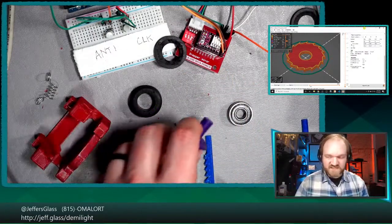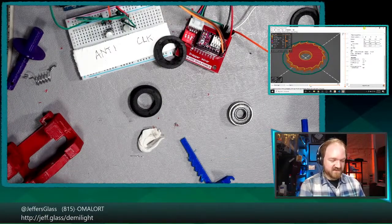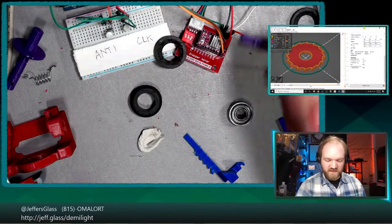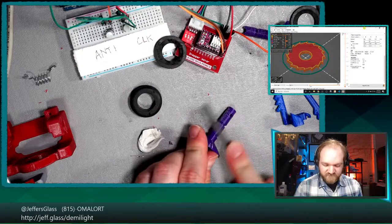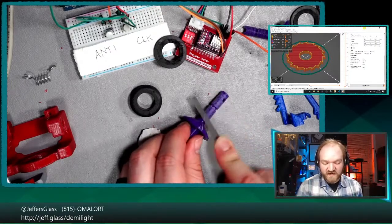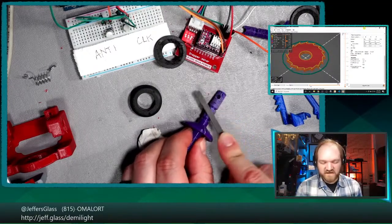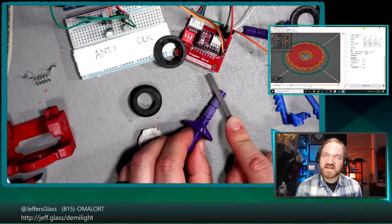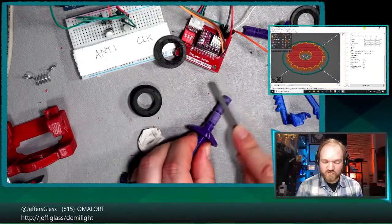Let's see. Oh, so here's an interesting tip for a very niche audience, which is I ran across an interesting phenomenon earlier this week, which will be obvious to some of you and maybe not obvious to some others of you. So we are finalizing the installation of various control parts into this airplane automation system that we have at the museum that I work at, that I've been working on for the past several months now. As part of the finishing extra touches to this control system, which essentially is a PC running a tkinter Python program that allows for automation sequencing of some basic aspects of the pneumatic actuators on the plane. And by basic control, it is basically just sending serial commands out of a serial port, which then get ported over RS-485 to a matching receiver at the plane, and that's responsible for turning those serial commands into actual control intent for the surfaces.